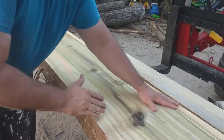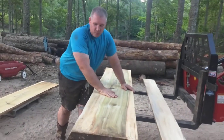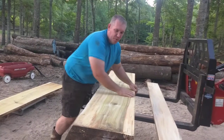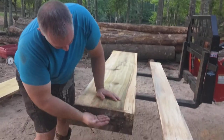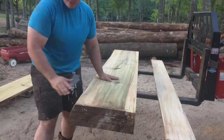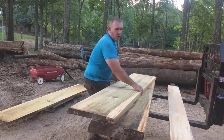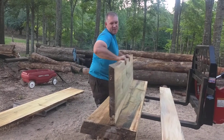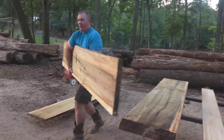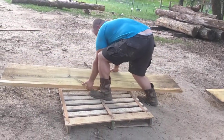It's only going to get better — the next slab I take off is going to be the pith, so you'll see a little more of the heartwood. I'll be throwing it on the pallet. The bookmatch set will be the two ends that meet up together. I'm going to fold this one out — it'll be saw-dusty on one side. These slabs are at nine feet, 18 inches wide, two inches thick, and rather heavy.